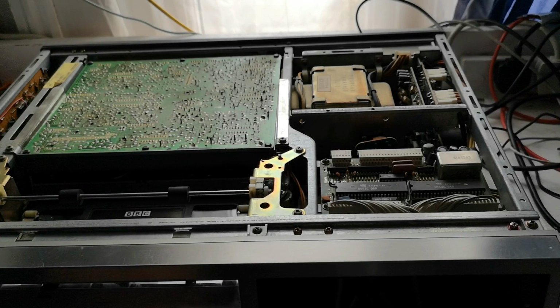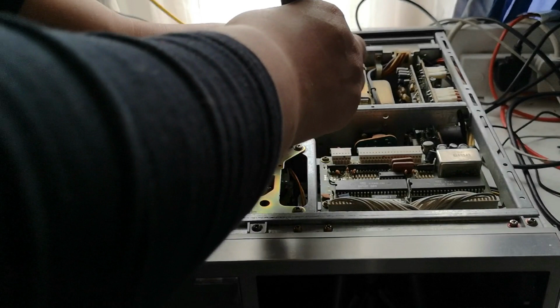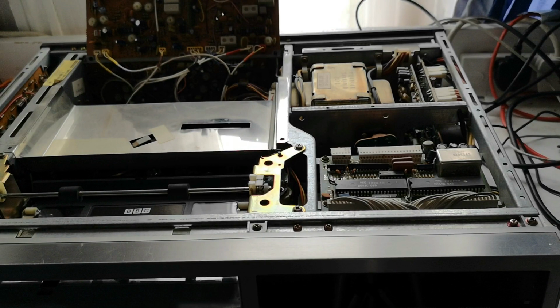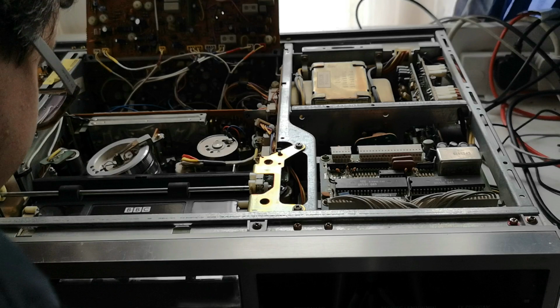Now, as we've discussed before on numerous videos, the audio on these is quite complex and over-engineered because the times 2 speed actually plays back the sound as well. N times 2 speed, and it uses something called a bucket brigade device. Apparently the actual training course for it was a day in its own right when these machines were new, and obviously all of the engineers were being trained on them. So there is another board back here, and I'm not sure what that one is.